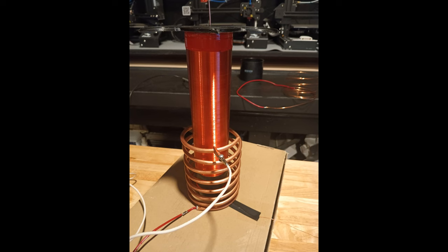Yeah, that's it, genius. Just add another capacitor, no matter if you're completely out of resonance or close to it. Nope, let's just add another capacitor. Apparently, you're not learning your lesson well enough. If I could reach through my TV right now and tap myself on the shoulder and tell this genius, hey, this is what's going on. It's time to change it because you're completely in the wrong. Set the resonance frequency to the number two coil. Then set your number one coil to that frequency. You must oscillate at a very low amount of power before you try to amp it up with more power.